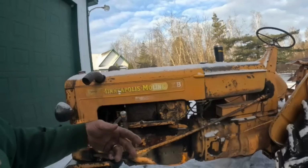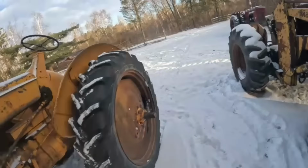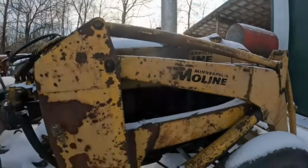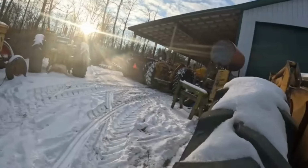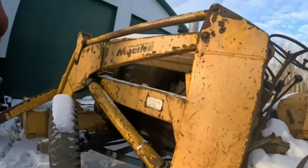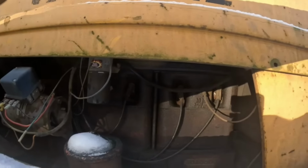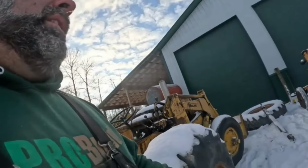The difference is these valves go side to side instead of up and down. Like, this is a 206 in this tractor here, which I know it's hard to see, but you can see the differences. It's got 2 split blocks with 2 pistons in each one and 2 separated heads, whereas this one has that flat head on the side of the motor.